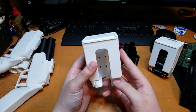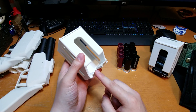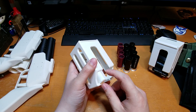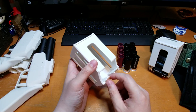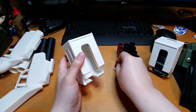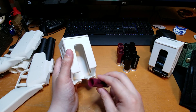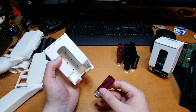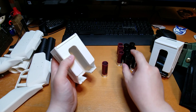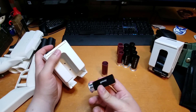When assembling, the first note is that the leaf springs are printed quite long. I've left them long so that people with different filament strengths and flexibility can trim them as needed to help retain shells. Different shotgun shells also have different diameters requiring different space to get them out. This is cut a little too big for the APS shell so it slides right out, whereas with the Goblin shells it actually takes a little bit of force to get them out.